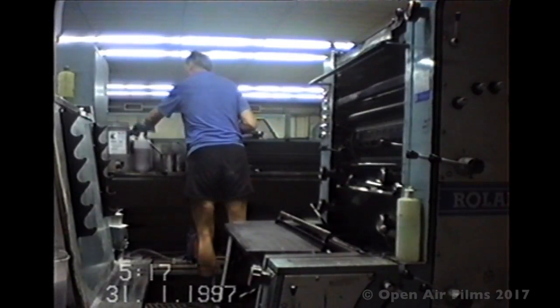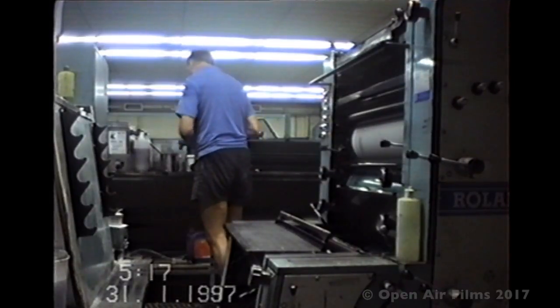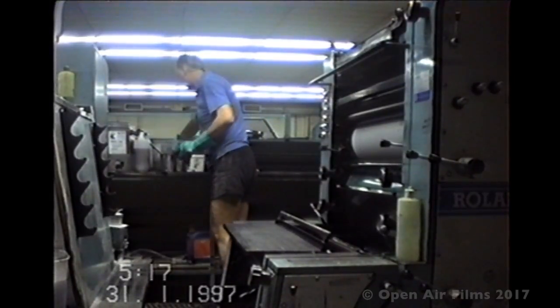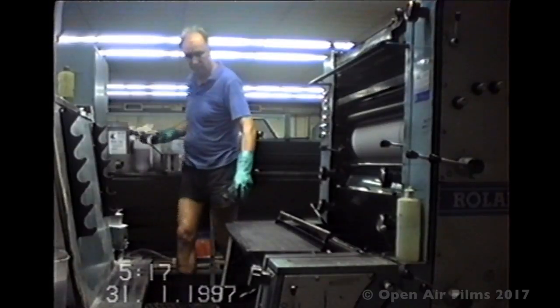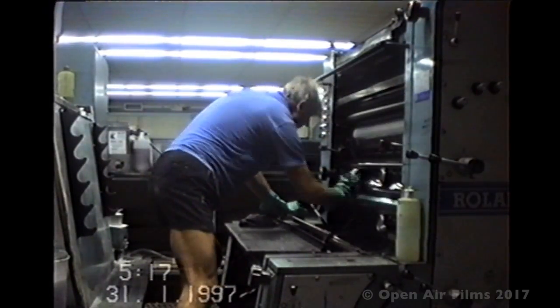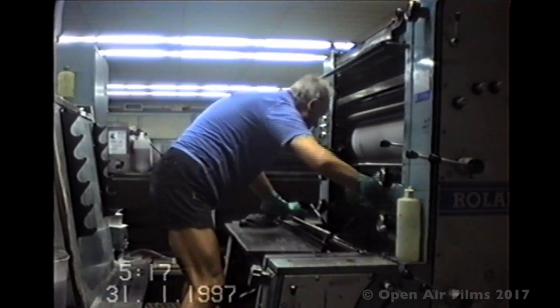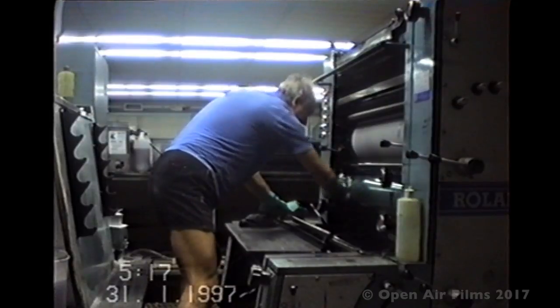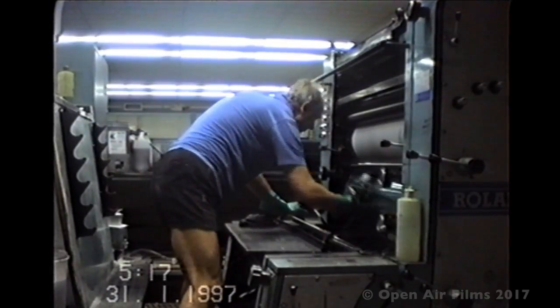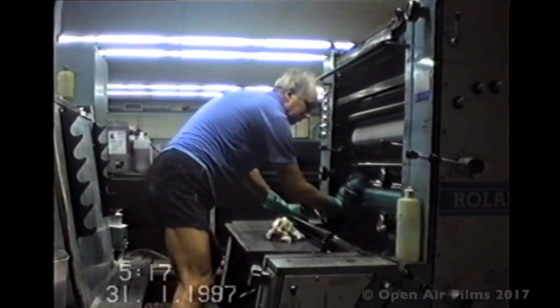And that's why we have the printer's devil, because anything that went wrong was blamed solely on the printer's devil. Now, what I'm using here, after doing the blankets with a wet sponge and removing the paper, I am now cleaning the printing off the blankets with a solvent. And you do this, and then you start up nice and fresh again.